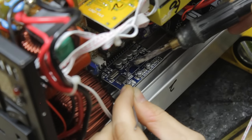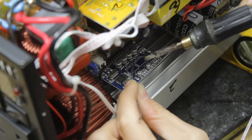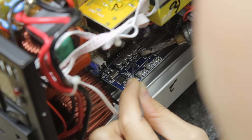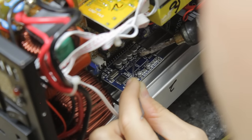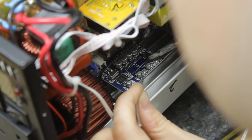You have to think, there's a reason why lead-free solder isn't allowed to be used in aerospace applications where human safety is absolutely critical, because it is widely accepted and known that lead-free solder just isn't as good and can cause issues, especially in those kind of environments where they're subjected to high swings in temperature or vibration and that sort of thing.